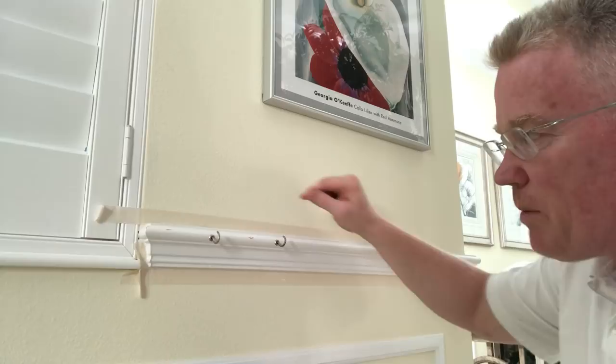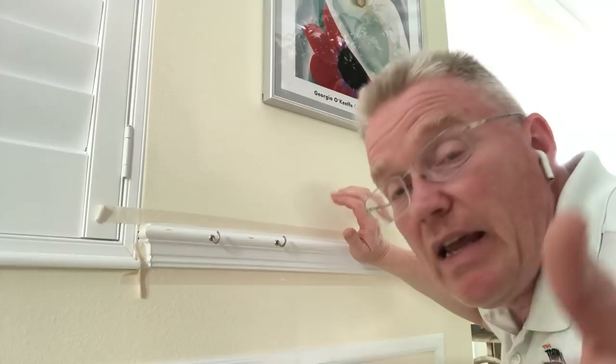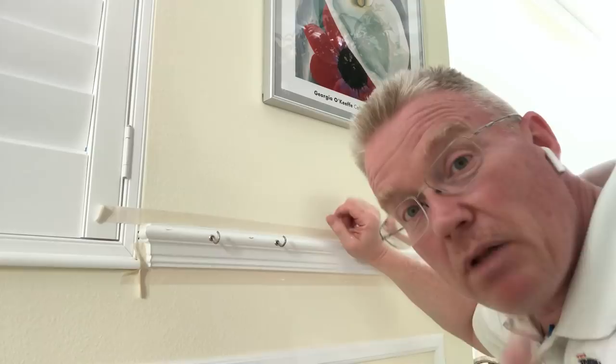To illustrate: let's say the surface were gray. You paint it gray, and the caulking gets covered in gray — but that tiny little edge, maybe an eightieth of an inch, where the tape meets the caulking, is going to be white because it was blocked by the edge of the tape. If you use clear caulking, you will solve the problem.